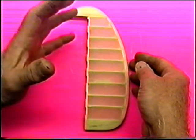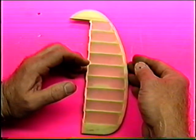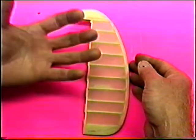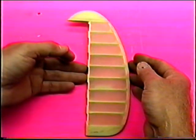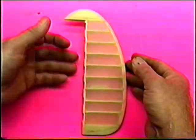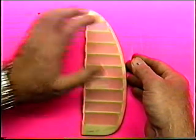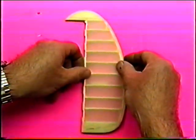The silver technique has been around for many, many years. The first person I ever knew that used it was Jim Silhavy. And I don't know exactly how he did it, but at some point in time in the mid-80s, I started using it myself. And it seems like it's a thing that's caught on in the area around here. Most people that I know use the silver, find the flaws, sand them out, until this part or the main frame of the plane is as perfect as you can make it. And that's a critical thing to remember.